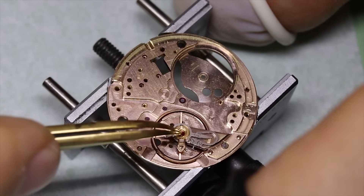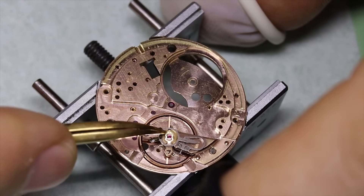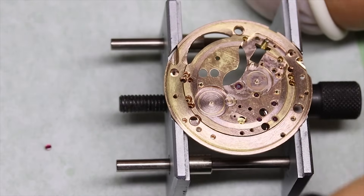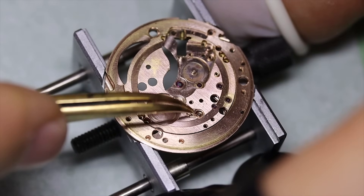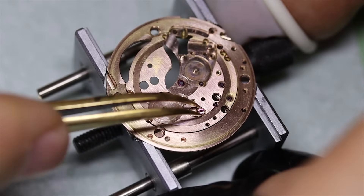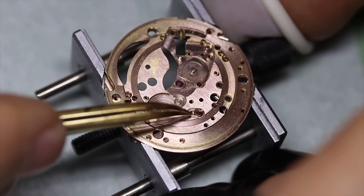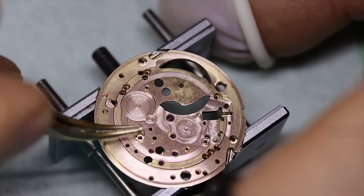There's not really any hidden thing that will allow you to break pivots, as you quite easily can with the third wheels on IWC calibers from the same time period, for instance. These movements were also very solidly made — just really built to last, as part of the Swiss culture to build things that will last 100 years. That is certainly the case with a movement like this.